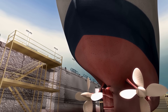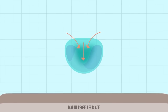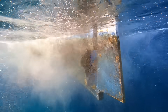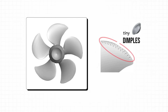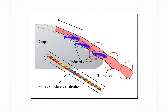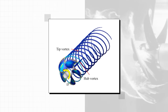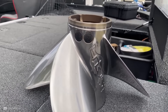Things started to get really interesting when I looked into marine propellers, and that is because of something called cavitation. Cavitation, where vapour bubbles form, implode and collapse in water, can cause serious problems for ship propellers, including noise, vibration and even physical damage. But a 2025 study shows that adding tiny dimples to the tip of propeller blades can dramatically reduce cavitation. Much like the dimples on a golf ball, these surface features disturb the flow of water in a helpful way. As water passes over the dimples, they create small swirling flows that even out the main tip vortices. The result is a much more stable flow that is far less likely to trigger cavitation. In fact, this treatment can apparently cut bubble formation by up to 95%, with almost no impact to the blade's overall performance.